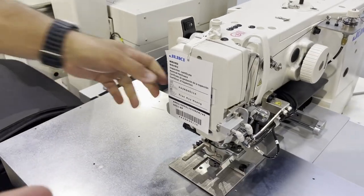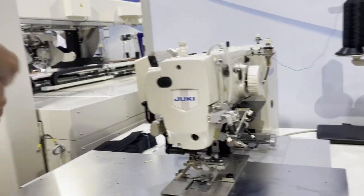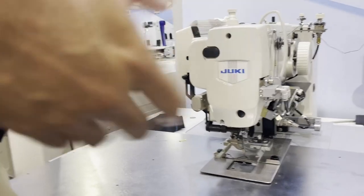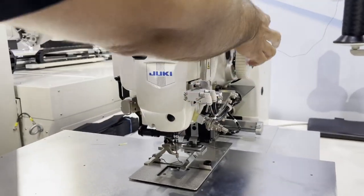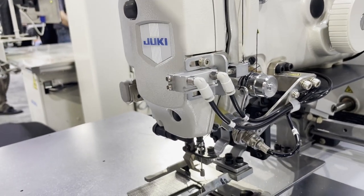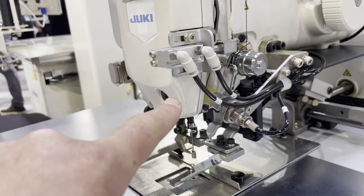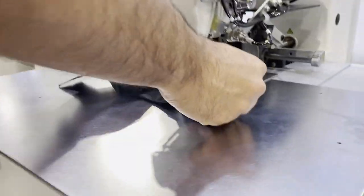This is a bar tack machine with a large platform. It's a programmable machine suited for heavy applications. It comes with an extra large hook to fit more thread so you don't have to change the bobbin constantly. It also has an additional tension post and a thread pullout to avoid the needle becoming unthreaded. The machine is electric 220V, three-phase, and also works with air — but you can also get it in 110V.